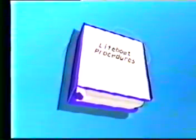Once the lifeboat is lowered to the water, as per the posted instructions, it must be released from the falls. The releasing gear installed in the lifeboat will release both ends of the lifeboat at the same instant. The releasing lever is clearly marked with the statement, "Caution, lever drops boat." It is extremely important that the boat is not released until it has reached the water. Launching procedures are vessel-specific. They can be found on the vessels and are practiced in the weekly lifeboat drill.